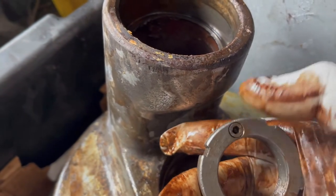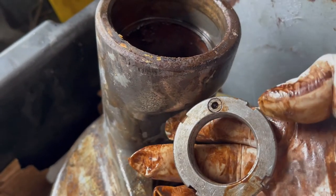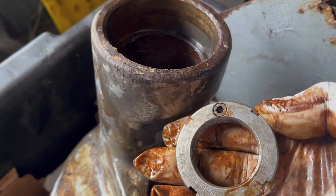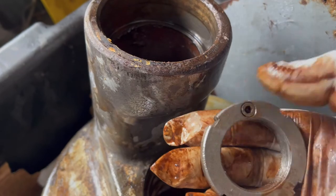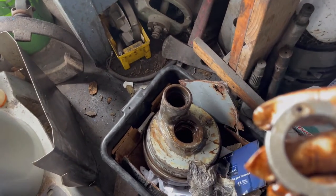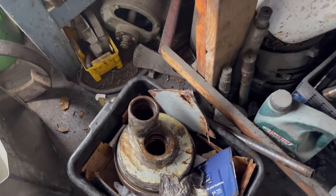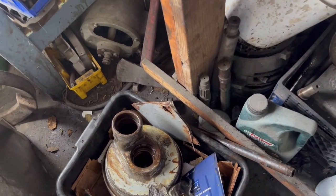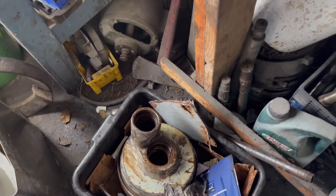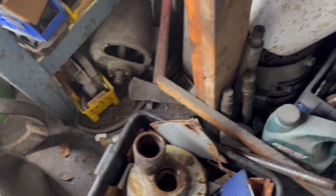Pay attention to this L-wrench screw. Don't start tapping this nut without removing this little bolt first. Once you do, the planetary will drop by itself. Under the nut you're going to find the washer that locks the little screw in place.